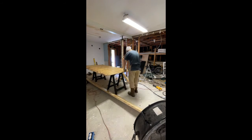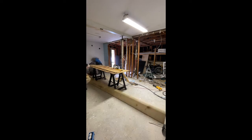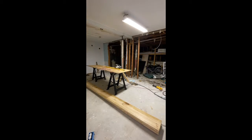My nephew joined me to build this supporting beam. We are using two 2x10s with half inch plywood between them. There really is not a lot of weight on this beam since the trusses run left to right in the building, as you can see in the back part of the room.